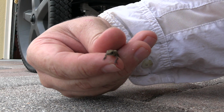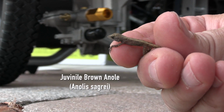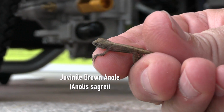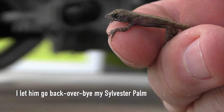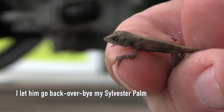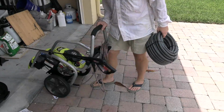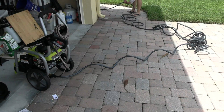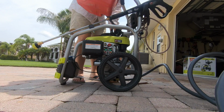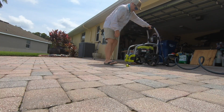And if you go back and watch the Sunjo electric pressure washer review I did, you'll see how it was just barely enough to get the job done when it comes to running a surface cleaner. That unit was 2,030 PSI and 1.7 gallons per minute. Now this Ryobi comes in at 3,100 PSI and 2.3 gallons per minute. So keep in mind, we are at 3,100 PSI, which is the top end of my criteria, and 2.3 gallons per minute, which falls within my criteria.